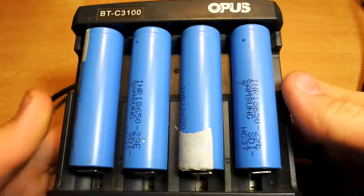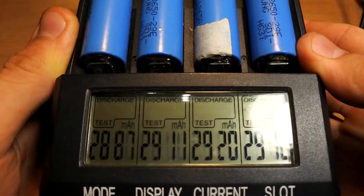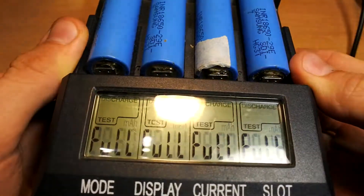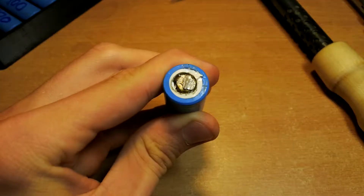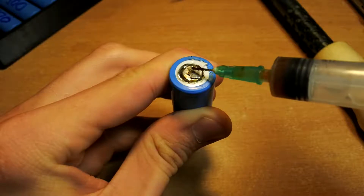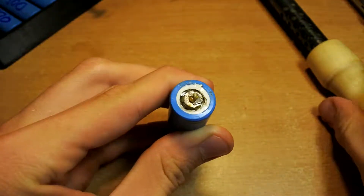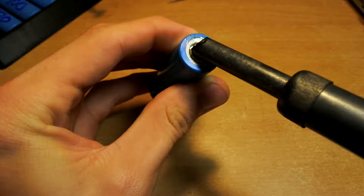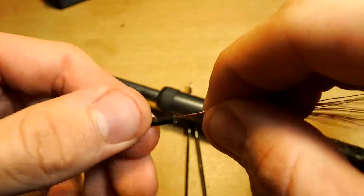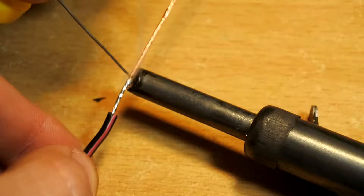It's time to choose the batteries we are going to use. I have only 4 with good quality and the 5th I will take with lower capacity. These batteries can be tinned easily if you know the secret: you have to take a powerful soldering iron near 100 watts and tin the battery in one touch, of course using flux. I recommend you to use only wires, not nickel plates — just believe me, they are really better.